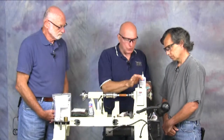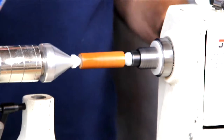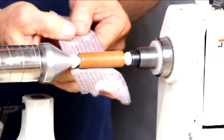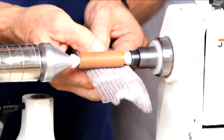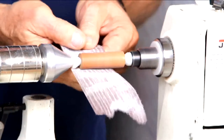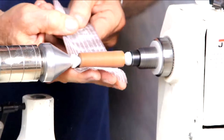I'm going to do one more coat and then we'll finish this. Now with 400 grit I'm going over this, and what I'm after is an even scratch pattern. You can see the lines that are still kind of shiny — those areas aren't getting that dull finish. I need to sand through until I get that nice dull look all the way across; then I know it's uniform. With this micro mesh, it looks like it's clogging but you just tap it and it all falls off, so you can use it for a long time.